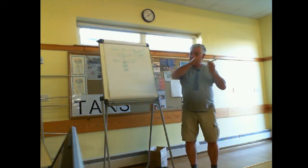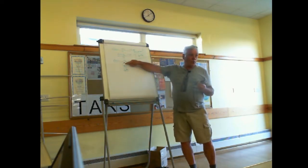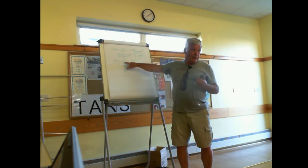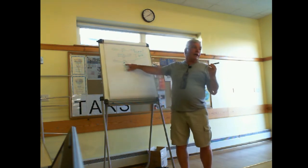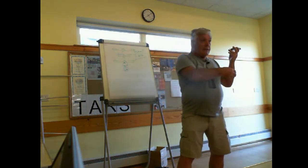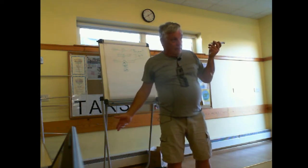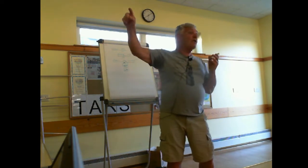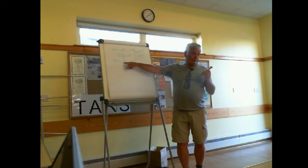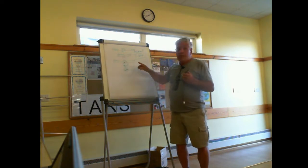But what you need to do is to connect this through all of that, first of all, and then, if you like, cut it off there. You've got to recreate that bit completely to get what that is. So, if you've got 50 foot of something, cable, ladder line, whatever it is, then you've got to put 50 foot of ladder line and cable onto this to null that all out, so that this is basically flatlining with all of that disappeared. Then you can connect it to find out what you've got here. So that is very important. But most of you don't do that.